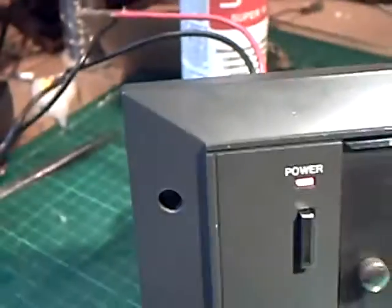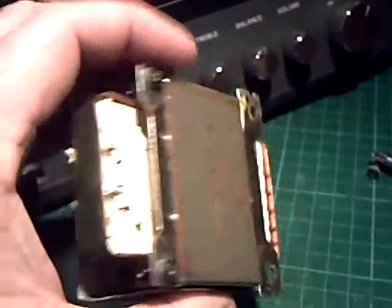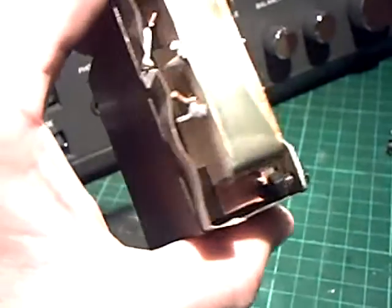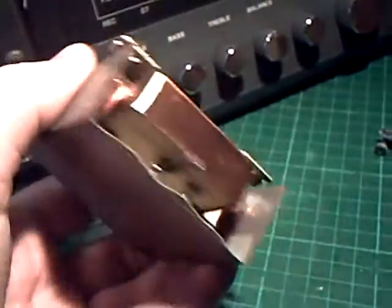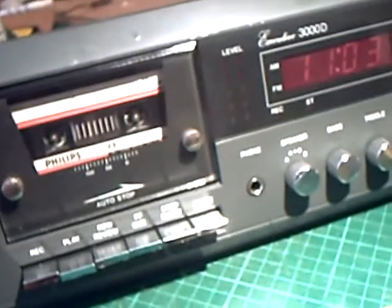But this one, I'm happy to report, has been altered so that it runs on 12 volts DC straight, and the original cables have even been used to do it. The transformer was still inside it — there it is, a somewhat compact affair. But I did look into using it, and I find that I can't, because there aren't the right tappings on there to permit me to use it on 240 rather than 120 volts. So better safe than sorry. For now it's running on this 12 volt, 3 amp power supply, and long term the plan is to install it here in the shed and run it on the 12 volt solar panel system.